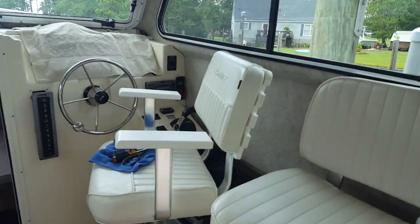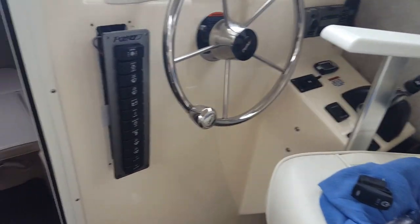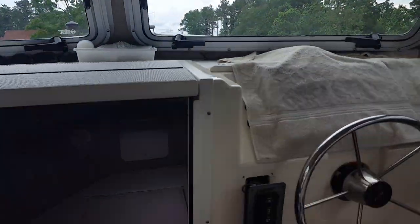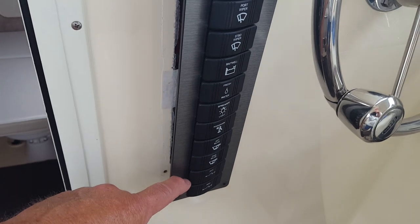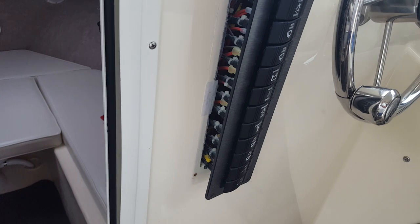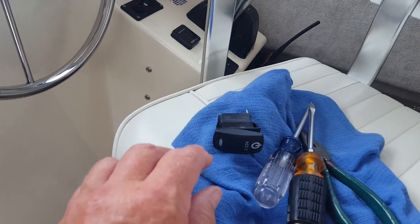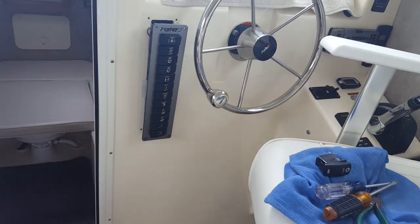I'm working on another project. The people in Classic Parker are phenomenal help — a fellow named Warthog is a genius. I was having trouble with the radar, brain boxes, chart plotter, and VHF all running through one switch down here. The switch overheated — it was rated for 15 amps. I got a 20 amp one now, and Warthog gave me clear direction on how to make it all work. I'm getting an electrician to help with that. Temporarily, I'm going to put in a heavier 20 amp switch and not run as much stuff through it.